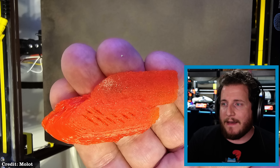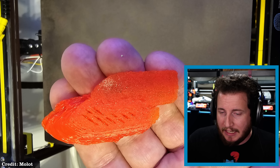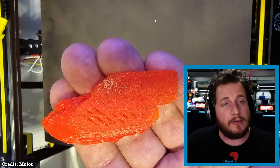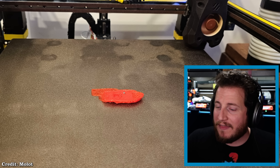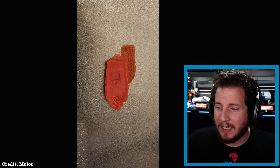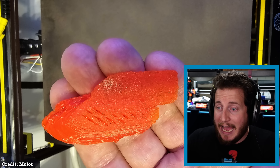This has been a fail that has plagued a few of us in the Discord for quite a few months. Member Malot, who has a Voron Trident and apparently had more success routing the belts than I did, has been dealing with the issue of layers shifting over and over on every single print. Looking at the failure, myself and a couple of others said it's probably a motor pulley — that the motor pulley is spinning, that it isn't tight on the shaft, and therefore when making those movements it's slipping. That would be the Occam's Razor thing.